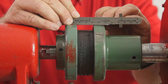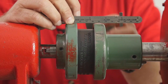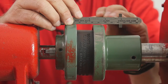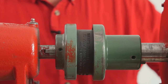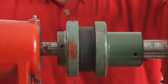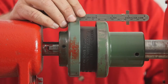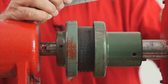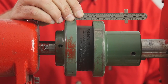There's one other thing I want you to see here. I can feel it almost drag in the front, but it's loose in the back, which tells me the back of this motor is lower than the front or the inboard. So right off the bat, we can tell there's a little bit of angularity — not that much, and it usually isn't that critical. In this case, if this 45 goes under just gently and doesn't touch, then I'm going to add 45 thousandths to each of these four motor feet, close that gap up, and get these roughed in.